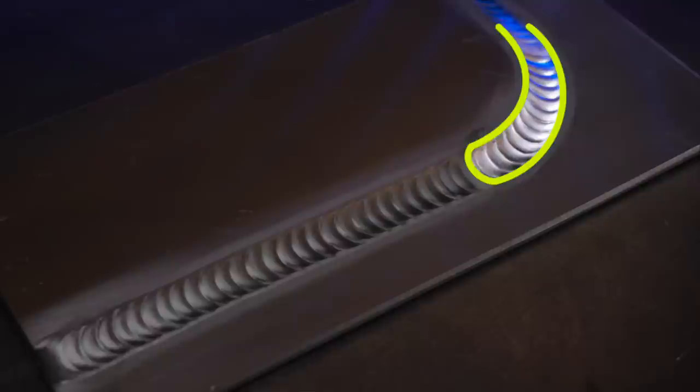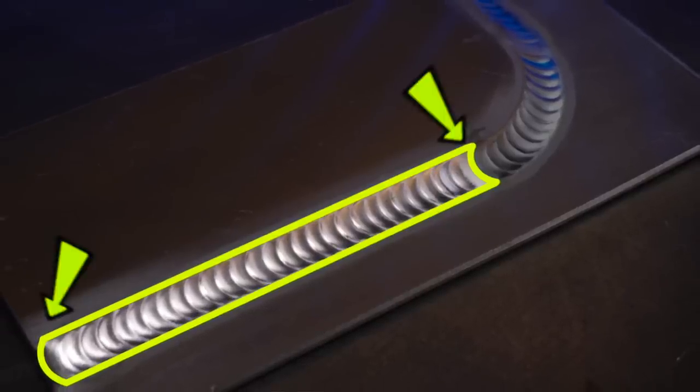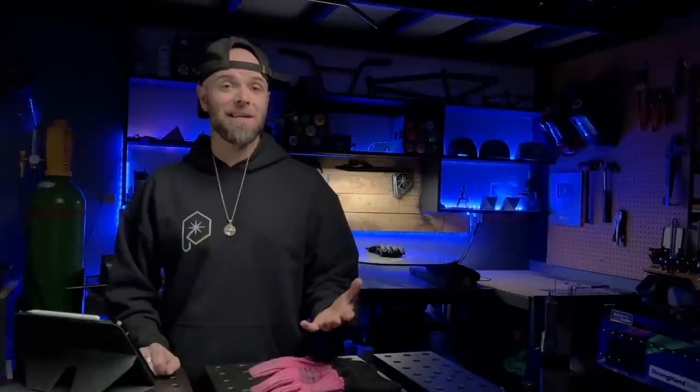Let's break this down in an even more exaggerated example. I was essentially trying to demonstrate how to make a weld look better by using a radius instead of a sharp corner, and I broke things down in exactly the same way. I have one straight shot that follows along the joint here. At this point I stopped completely, reset, got comfortable again, and after I was ready I set up and started welding the radius corner. This corner is a little bit exaggerated, but performing it independently of the two straight passes set me up perfectly to perform each straight pass with great comfort, following the joint perfectly. Instead of thinking about working around a corner in two passes, it was broken down into three separate passes — so not only did we ensure everything is connected properly, but doing it with good consistency, it turned out silky smooth.